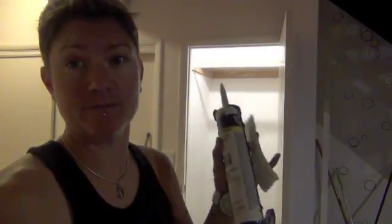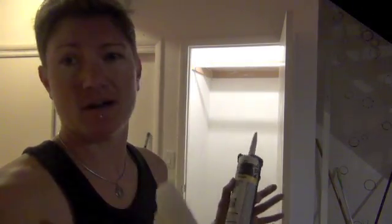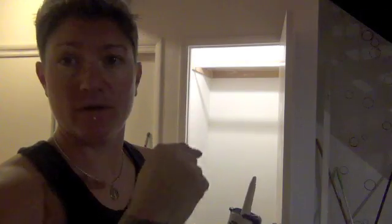When I set this trim, I did put just 1 little nail in this leg and 1 little nail in this leg, so that when I put the top piece on, I could wiggle those a little bit to change the gap. You can always caulk that crack, but it helps have a little wiggle room when you're putting that last piece on, then attach everything. It's important when caulking to follow up with a wet finger, so caulk, paper towel or towel, run a line, wet your finger, follow.